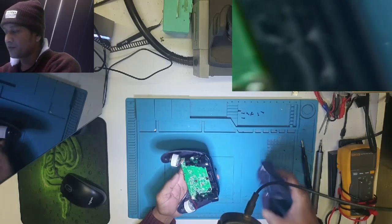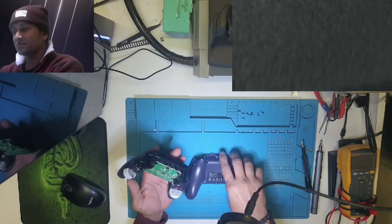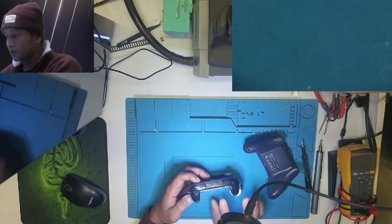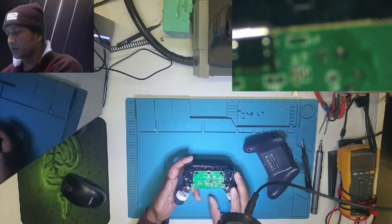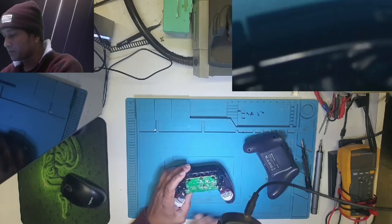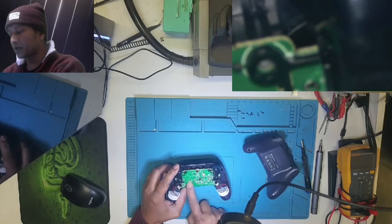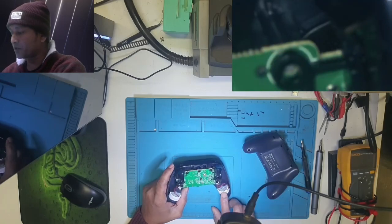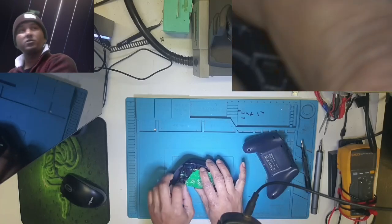Great. It's very easy to remove. Only remove those screws and then the whole shell will come out. So for this USB, I need to work on that. Let's remove the board and see how we can do that. There is one screw here that I can see. I think we need to remove that and then hopefully it will come off. Remove this vibrator motors connector out.